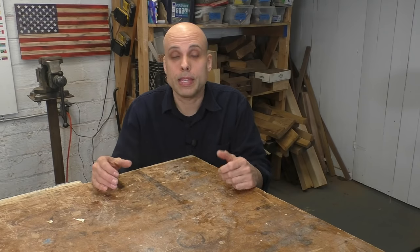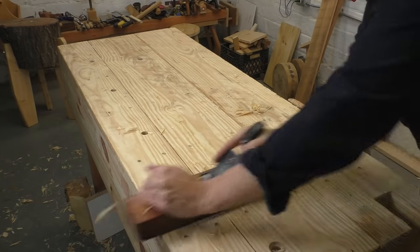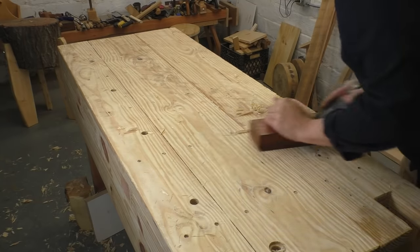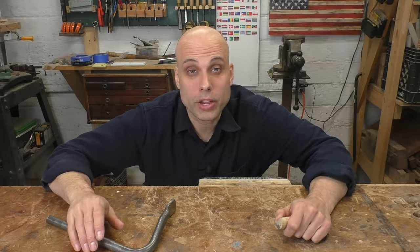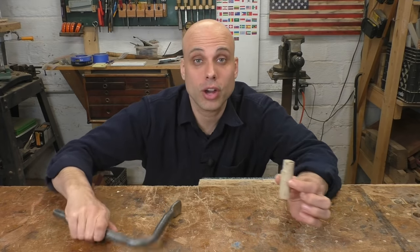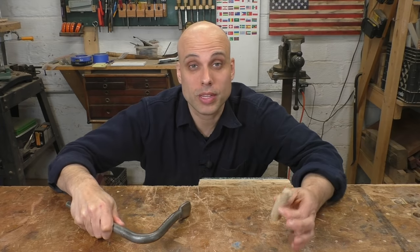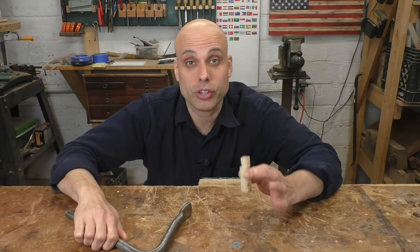The problem is, having a messed up, uneven benchtop is bad for your furniture. It'll dent your components. It's actually much better if you can freshen up that benchtop at least once a year, maybe more often. With a synthetic top, you really can't do that. A solid wood top is cheaper and it's easy to refresh anytime you want. One great way to make your bench more adaptable in the future is just adding simple accessories like bench dogs and holdfasts. Neither one of these costs very much. You can make the dogs in your shop, and they expand what your bench can do a lot.